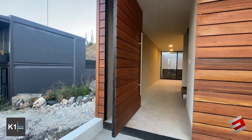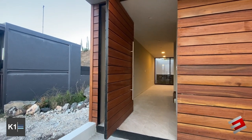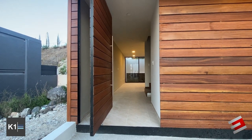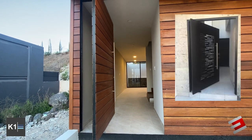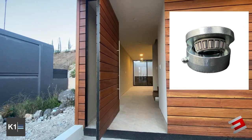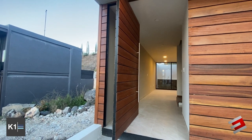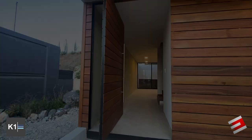Now friends, we have a new opening system. Omar, tell us a little bit about the door. For doors of more than 1.30m or 1.40m, you can use an opening of this type called Tejuelo, which is a bit more of a statement for how the door opens. It is essentially an edge on which it turns. This one is exactly 1.5m, so it is a huge door. It also helps that the hinges don't wear out over time, because the Tejuelo is supported on both the floor and the ceiling.